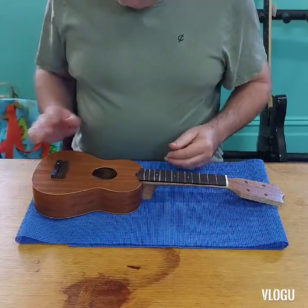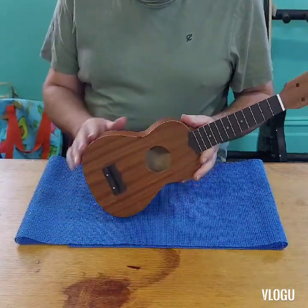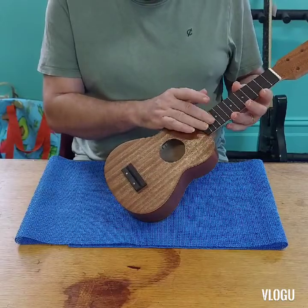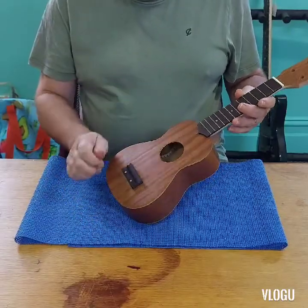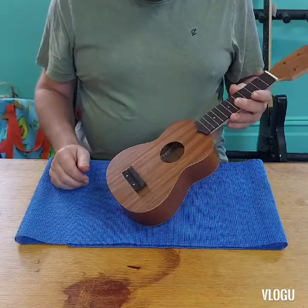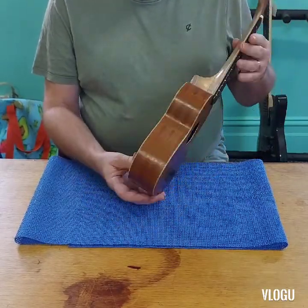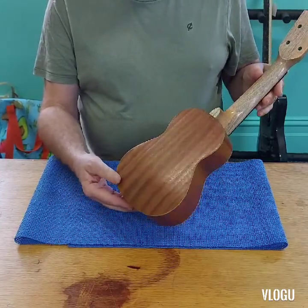We are back and as you can see everything is unmasked and this little ukulele has had a coat of clear. We masked off the fretboard and the bridge, then went over with a few coats of clear — just thin coats to start with. You'll find sapele is an open grain timber so quite a bit soaks in. You can grain fill it if you want, but I wanted a fairly natural, open grain look. You can see how it brings up the color of the sapele — it's quite a pretty timber.